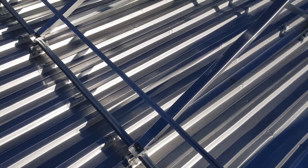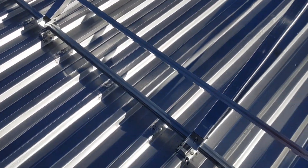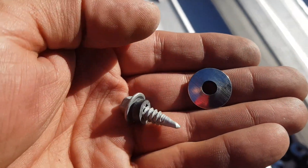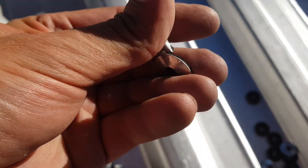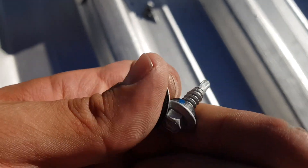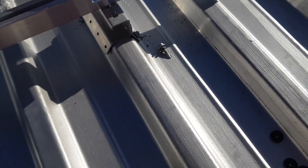We'll put on the panels as soon as they arrive on the roof and screw everything down nice and tight. I'm going to install the earth wire between the rails and on the panels when they're on. When we tighten these from KD onto the roof brackets, we insert these spacers as an extra precaution — without them, the little rubber seal will just rip apart or open up too wide. With the spacer or washer, you get a good tight seal and a much better connection to the roof.